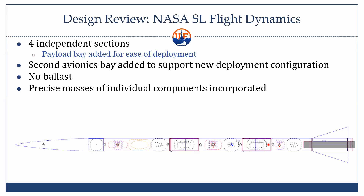Our most recent previous design would have had the main parachute and drogue deploy together from the aft section, which could have caused tangling and other problems. This new configuration is generally safer. The one concern is it does make our rocket fairly long, so we're keeping an eye on that. Because we have this separate section with a separate separation point, we've added a new avionics bay to house the equipment that'll accommodate that second separation event.